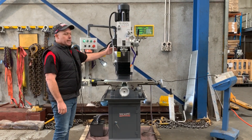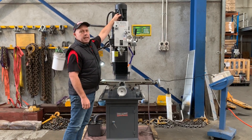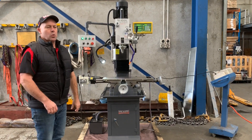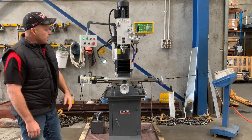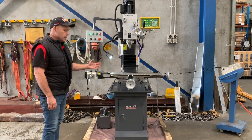Some of the key features include an MT4 spindle, which is held by an M16 drawbar. You can put your drilling and also all of your drawbar-type milling cutters in there. It has a very large work table — about 800 x 240 — with T-slots of course.